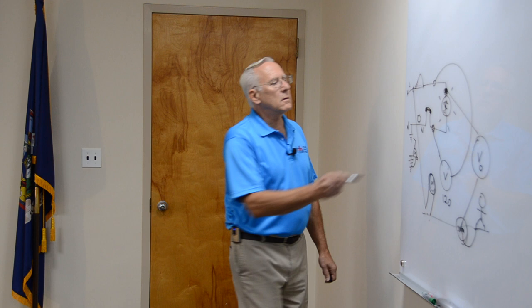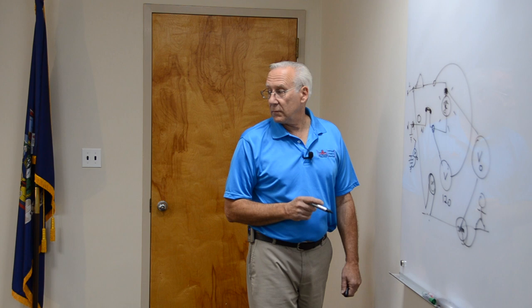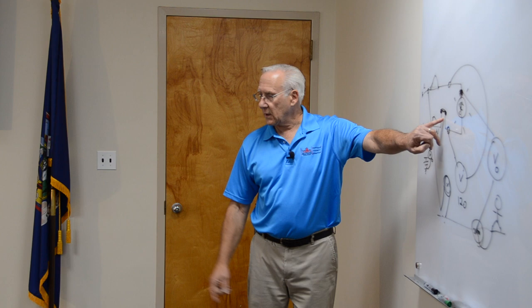You don't want to test it to the circuit because that's only going to tell you if there's a problem in the circuit, but it's not going to tell you if it's live or dead. Because you're going to get false readings if it's neutral. Like I just showed you. I'm going to go over that again. These are the alligator clips that I have right here.